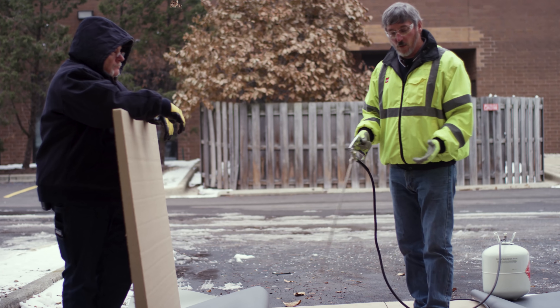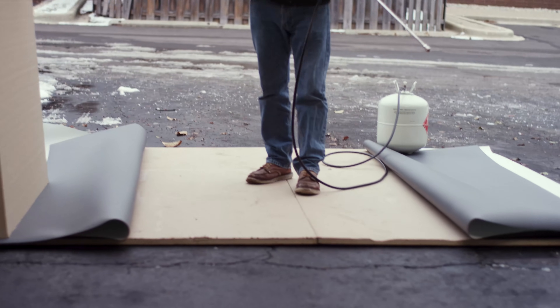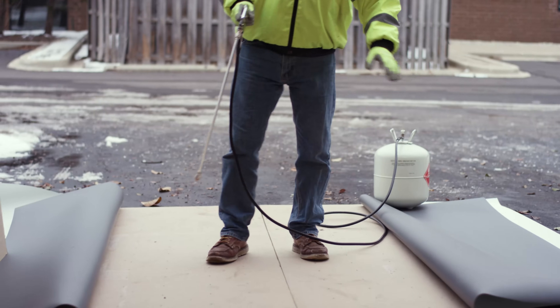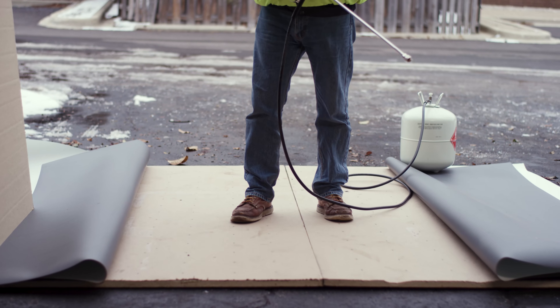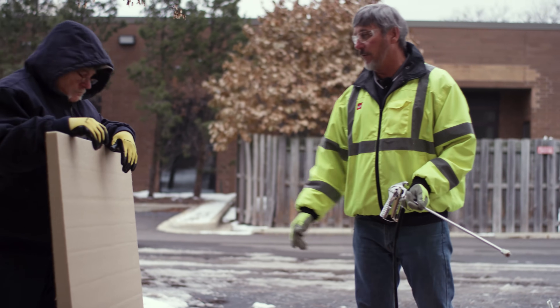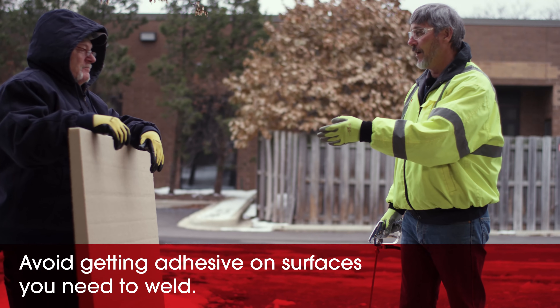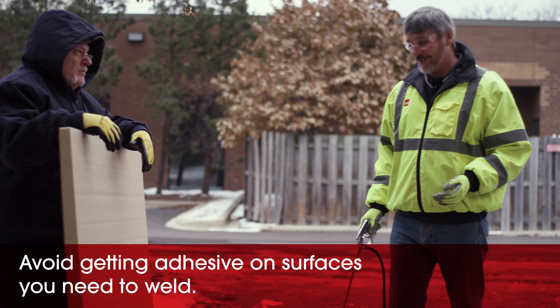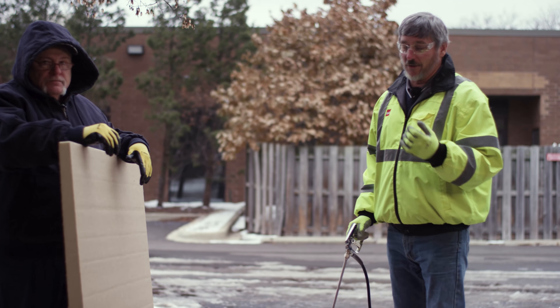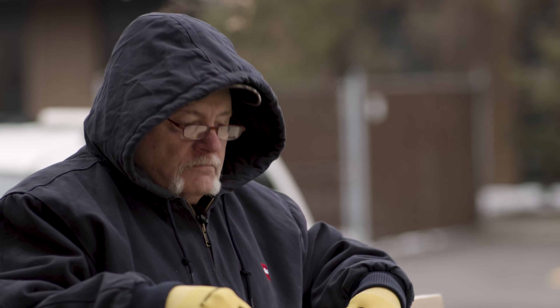So what we're going to do now is go over a typical installation. You can see we've got a couple of sheets here. This is one way to lay out — it's called a butterfly. Fold one half back, one half back. Now the thing to remember if you go about it this way is this sheet is going to lap onto this one, so you've got to be careful not to get any adhesive along that seam. Dave, why are you standing there during the installation? So you don't get adhesive on that seam — not to mention yourself. And that's another thing you've got to really take into consideration on a windy day: if you're working on a roof and there are cars in a parking lot, you better get those moved.